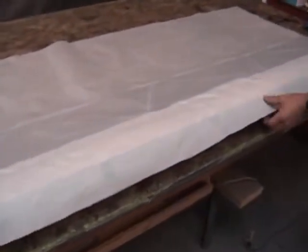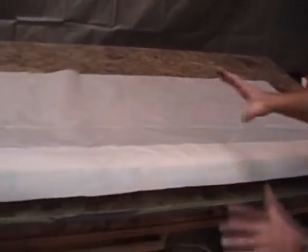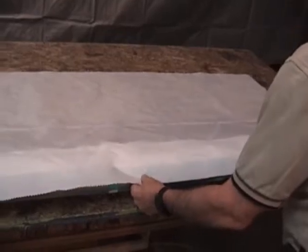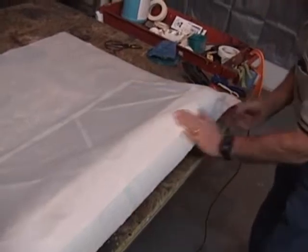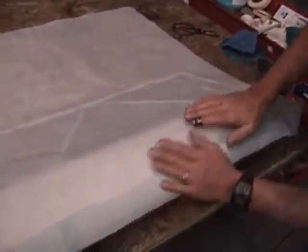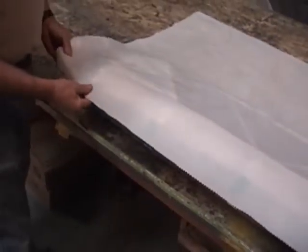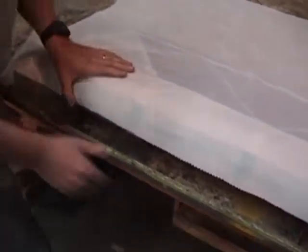The main thing now is just to get it lined up on the aileron where the surface you're working on — try to get it square to the surface. Then what we're going to do is just use some hand pressure and lightly rub this into that dried glue. It makes this very nice to work with, kind of like a postal sticker at this stage. You can see we can actually work this fabric, but we're not fighting a wet glue.